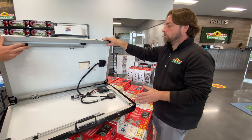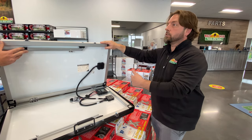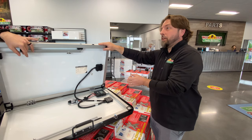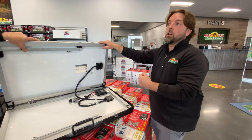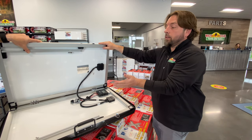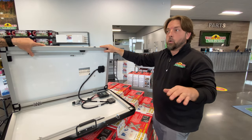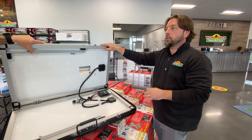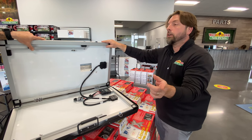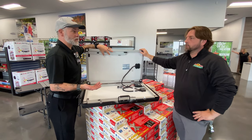The output also depends on what kind of battery you have. With a standard 24-series RV marine battery you'll get decent power; if you go to a 27-series — just a little bit bigger — you can store a little more. A good example of what this panel will do: a lot of newer campers have the EverChill 12-volt refrigerator, which is a compressor-style DC-voltage fridge. This panel is enough to keep that running all day long on a 27-series battery.